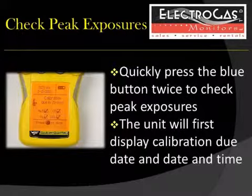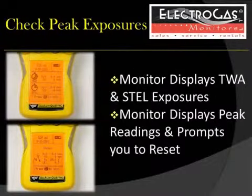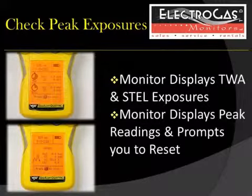The unit will first display the calibration due date and time. Time-weighted average and short-term exposures will be displayed first, and they are followed by the peak readings and a prompt to reset. To reset the peak readings, simply press the blue button.